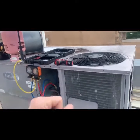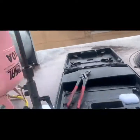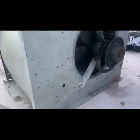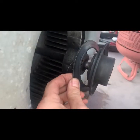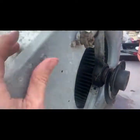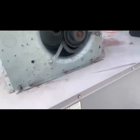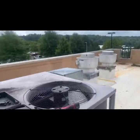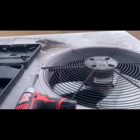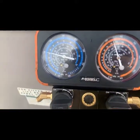We're up on the roof doing mechanicals this morning and we find this. When we retire units we scavenge them, so I had another Carrier blower unit — this is just a six-ton Carrier — so we put another blower assembly in, got it set up, fired it up, and the unit is short cycling. It's 410A and I'm hooked up to it.